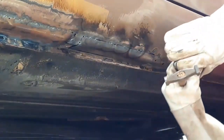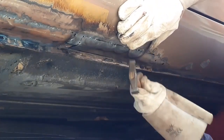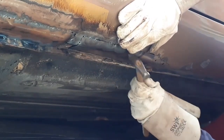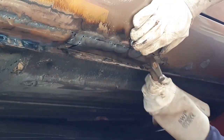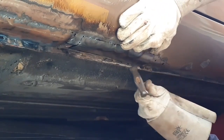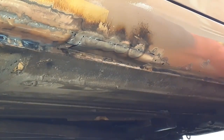I'll pop the weight here. I need to keep that flat, and if I bang on the curve it should close a half a millimeter gap — which you won't be able to see from the distance of the camera — but if I close this first. Just by holding the weight on the curve of the original panel, it stops any movement. There we go, that's okay.